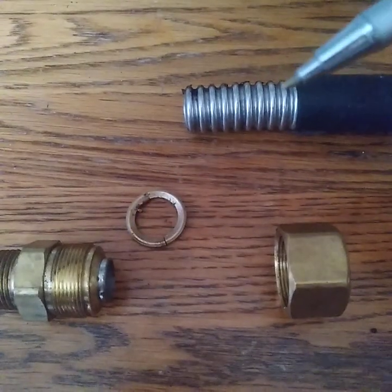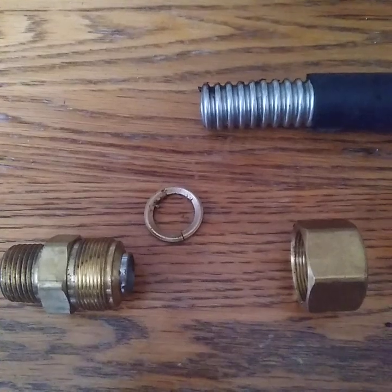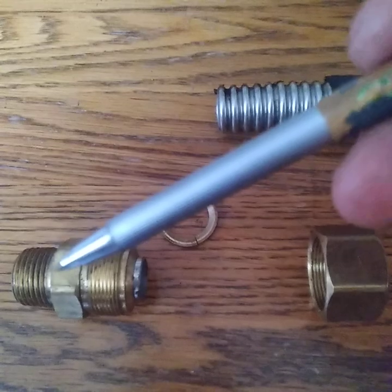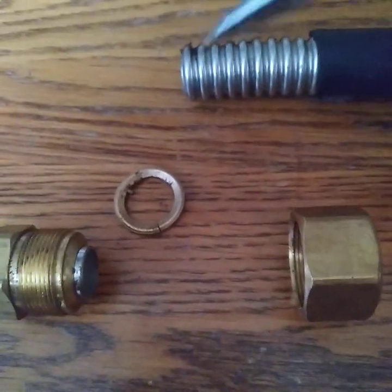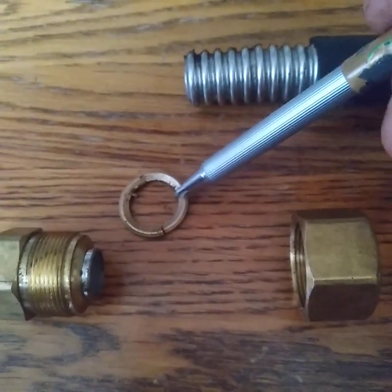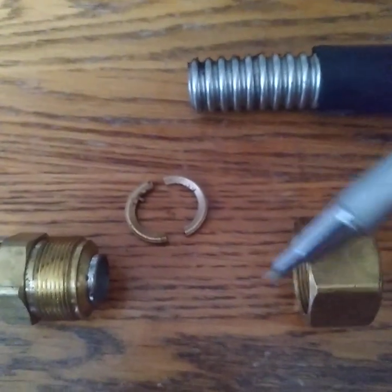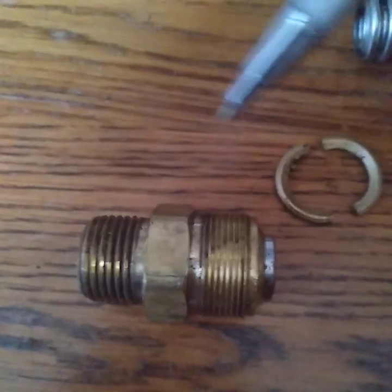And then once it's done, you can spray it with dish detergent and water and see if it bubbles up. But again, let's reiterate. Coupling, CSST, that looks similar to a flared fitting. Nut goes on first. This goes on secondly in two separate pieces around here in this groove. Pull the nut up, tighten it. This can be put into a black iron fitting. This is a regular NPT fitting, National Pipe Thread.